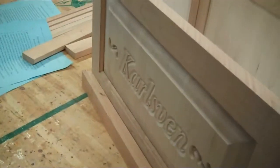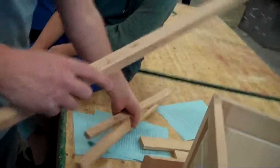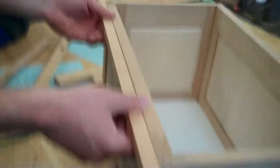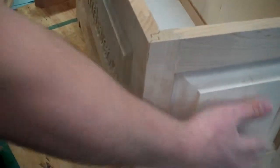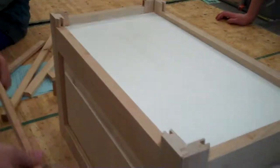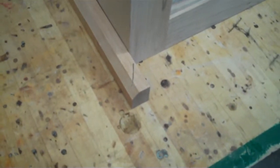Continue the process all the way around and cut all your moldings. That's the bottom moldings. When you do your top ones — the smaller ones — it's the same exact process: mark the angle direction, cut one angle, line it up, draw the back side, and cut the other angle. It's difficult to do this on your project because they keep moving and falling. I'd recommend flip your whole project upside down and do the same thing — just line them up, cut one angle, mark the back side, and cut it all the way around. It's easier when you flip it upside down so the table holds it for you.